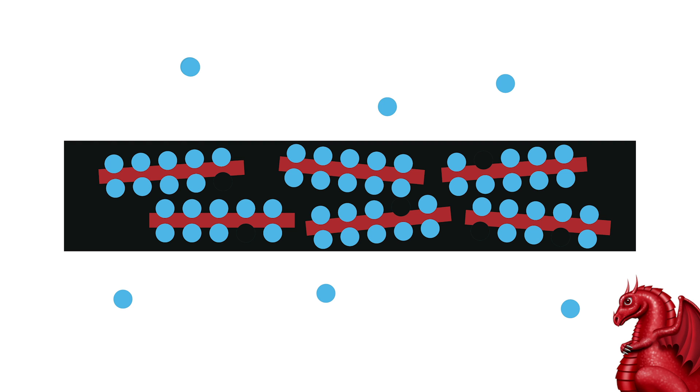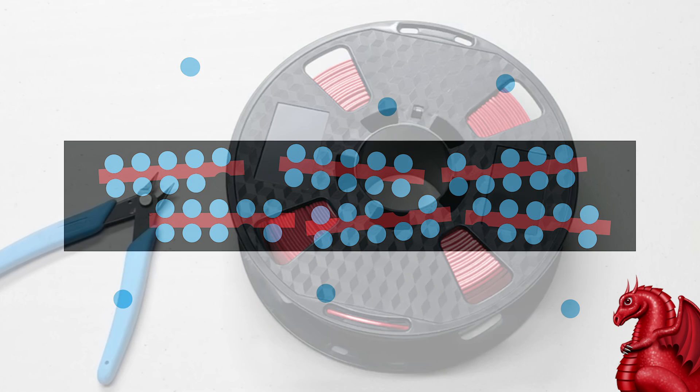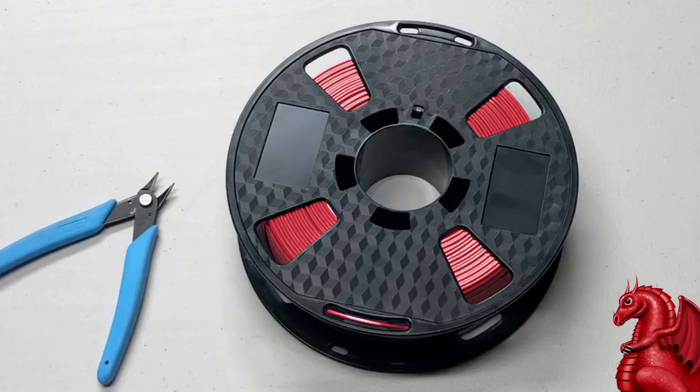The reason for this is that as your filament gains more water, that water when it goes through the hot end and the heated nozzle is going to cook off — it's going to be converted to steam, and that steam has to escape. The only way for it to escape is out the end of the nozzle. In a perfect world, the only thing that should come out the end of your nozzle is molten filament. If you have steam escaping at the same time, that's going to create inconsistent extrusion, it can look like little bubbles in the print, and that steam can push out additional filament, creating stringing.